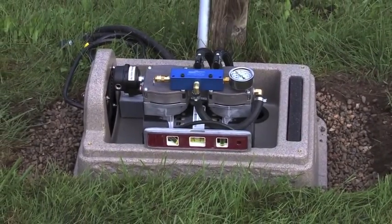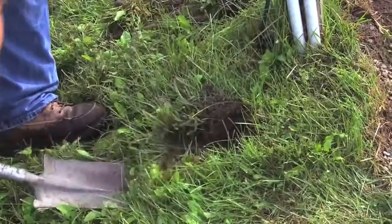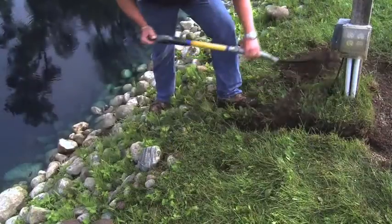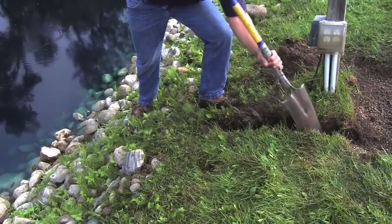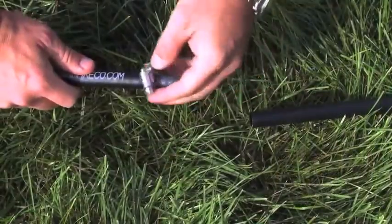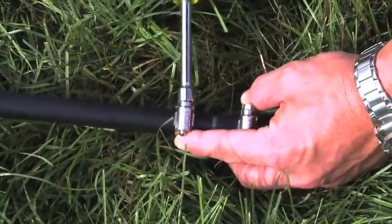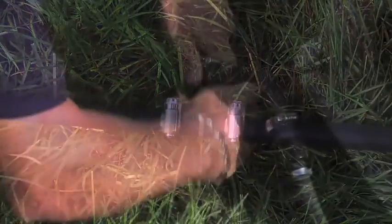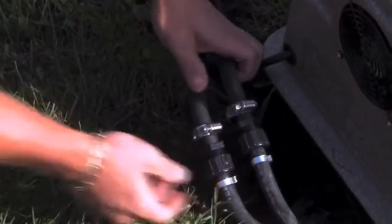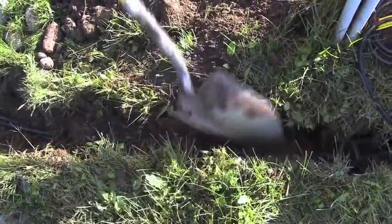Once the ground is prepped, place the cabinet and use a small level to ensure the cabinet rests securely and is level. With the cabinet set, you're ready to trench to the pond's edge. If your trench is going to be more than several feet away from the shore or in an area that will receive traffic from a lawn tractor or other equipment, it is recommended that you use Air Max Direct Burial Airline or place the easy set self-weighted airline in a piece of PVC pipe to protect it from crushing. Be sure that your trench is at least eight inches in depth. For longer trenches, you may need to connect multiple rolls of direct burial airline together. If you're operating multiple plates, run a separate airline for each diffuser. Once all of the airline is placed in the trench, connect your airline to the cabinet using the provided connector kits. Backfill a few areas to keep the airline in place, but do not backfill the entire trench at this point — we will come back to this later.